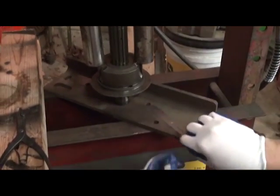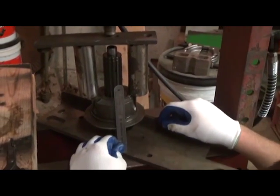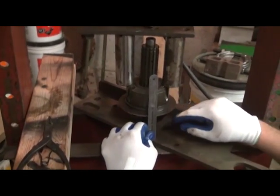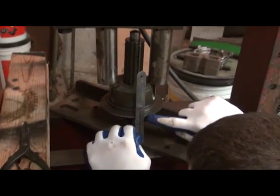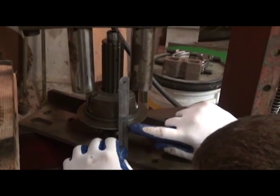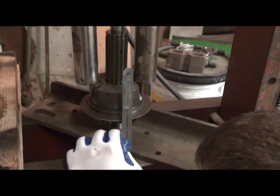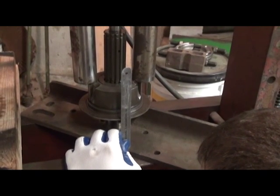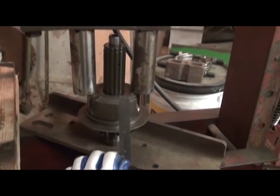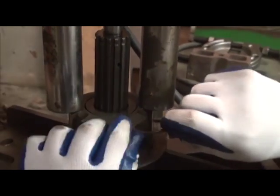Okay. Now, according to John Deere, we are going to let the cam assembly return 5/32 of an inch. We're going to let the springs expand that far. So we notice on our measurement, you see right where we are. One, 2, 3, 4, 5. That's 5/32. And it actually looks like we're probably not going to be able to get another shim washer in.